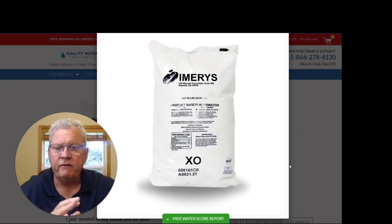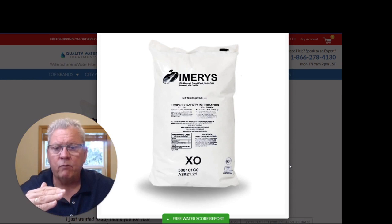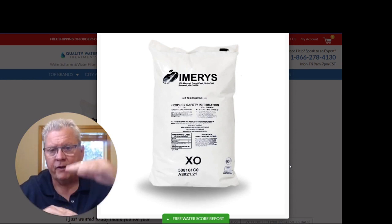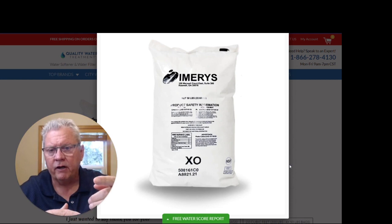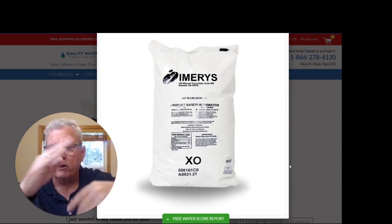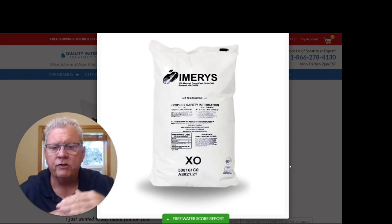Inside the tank you're going to see a distributor tube — a PVC pipe in the center of the tank. Use some sort of cap, or in most cases tape, and put a small amount of tape over the top of that distributor tube. Then use a funnel, set it over the top of the tank and over the top of that tube, and add your calcite to where you have anywhere from 10 to 12 inches of what we call freeboard — the room between the calcite and the top of the tank. It's very important not to go more than 10 to 12 inches, because when the system goes to backwash itself automatically, it has to be able to lift that calcite up and turn it over. If you don't leave that room, it won't be able to move and you'll have problems. Make sure you leave 10 to 12 inches.